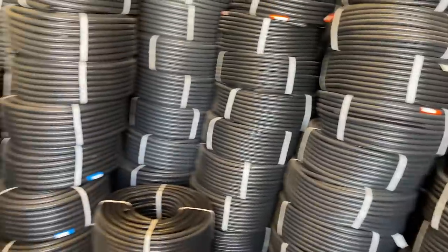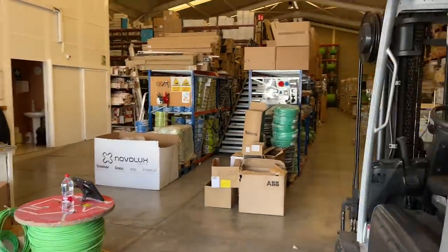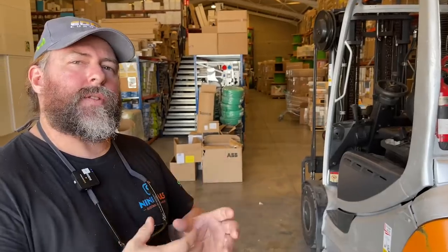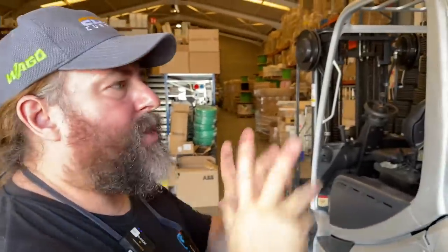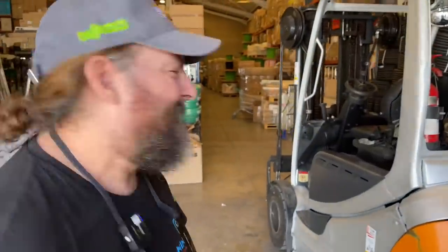Right, so your regulations would tell you what type of conduit to use on a circuit? Exactly, yeah. We have cable calculations, so the same as the UK, the capacity calculations that tell you how many cables that you can put in of a certain size within the tube. You normally fill it to about 70%. Okay, so your first fix is just the conduit in, isn't it? It's just the conduit in and the boxes, and the register boxes, which we're going to go and see now. Okay, let's find a register box.